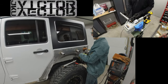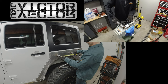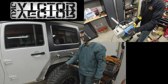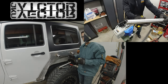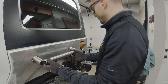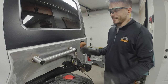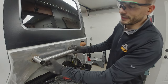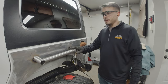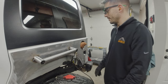I need to determine where the notches need to be placed. I'm at 12 and 7/8 inches for the tightest point, so I'll mark the tube and shoot for those two tightest areas for the notching. After cutting the first tube notch and checking the fit, I'm really happy with how tightly it fit — very little play and nice and flush. I'll just make the rest of the posts and connect them with similar cut pieces.